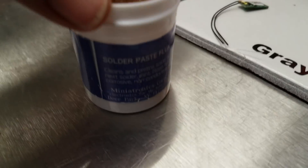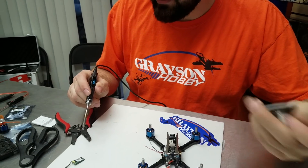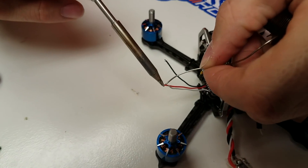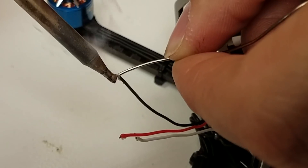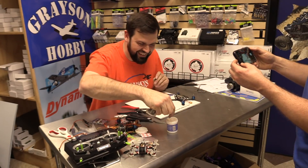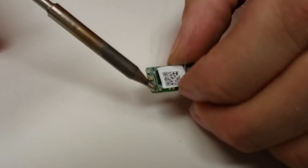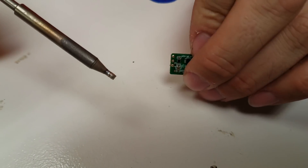We got flux on the wire. This is called solder-paste flux. I'm going to set it to 300 to 400 degrees Celsius for small wires like this — you just don't want to hold the iron on anything too long. Tin the wire — about one second on the wire. You can also use the solder to flux. Just put a little flux where the pins go and tin it. You can see how quick it flows — flux makes everything so much faster.